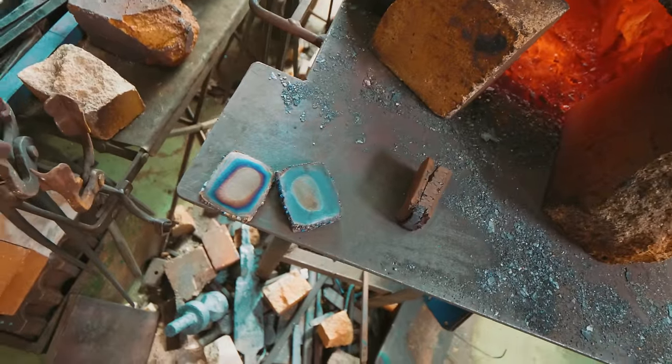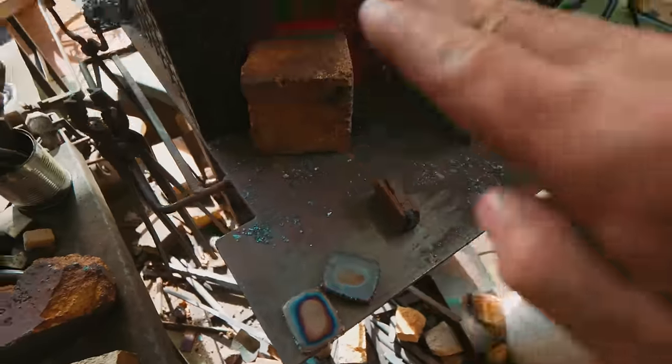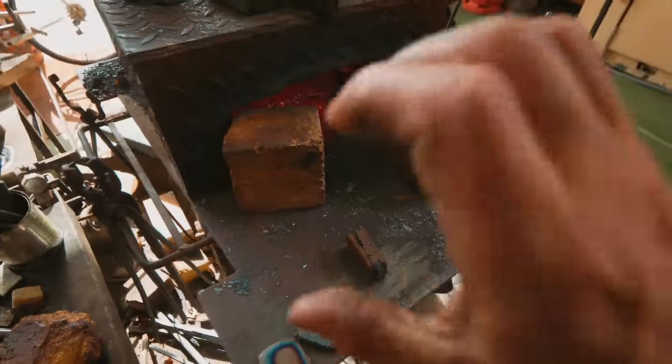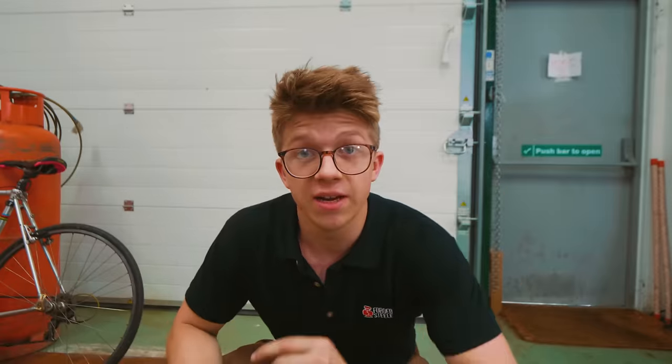This is a dangerous one to be doing in the home shop. I presume the better way to do this is in a can, like they make titanium Damascus — but again, there is a patent on that process, so I'm trying to be respectful of that and not doing commercial activity based around something that's patented. What they do when making titanium Damascus is stack up the layers of titanium and purge it with argon as it heats up. It's some super interesting stuff. And I know it's possible — we just didn't make it work today.